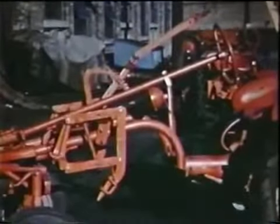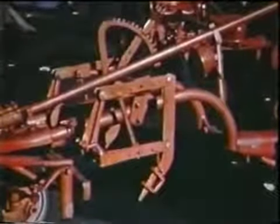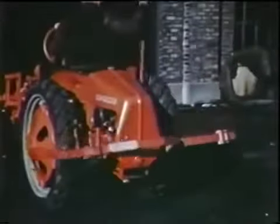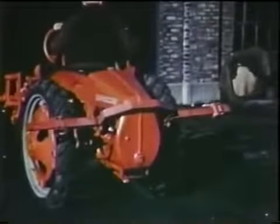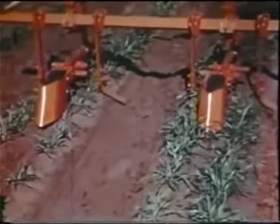Tillage tools include a heavy-duty 12-inch plow. All are easily and quickly attached or detached in less than five minutes — no jack or crowbars necessary. To make this possible, there's a master tool carrier and a master hand lift with parallel linkage that keeps the tools level, used with all mounted tools. A rear furrowing bar completes the three basic units.